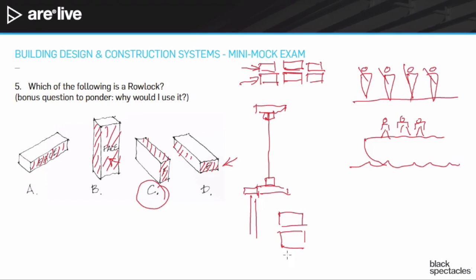Sort of a regular brick wall. If I put just another brick right on there, first of all, that brick is likely to be one that has holes in it in order to make it a little bit lighter and to make it harden in the kiln process better. So I want to put something there but not have this face showing. If I just put another brick, it would be the wrong face. So I put that face showing. I stand it up. I break it off on the edge.